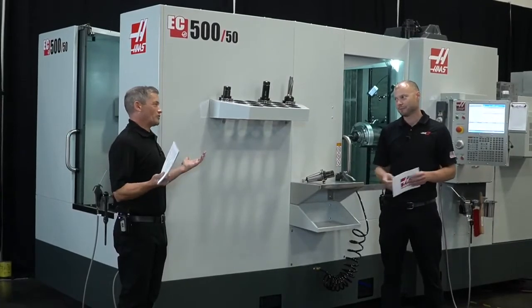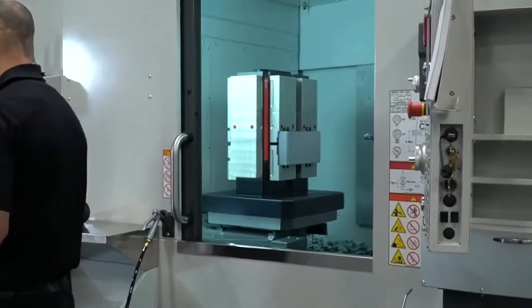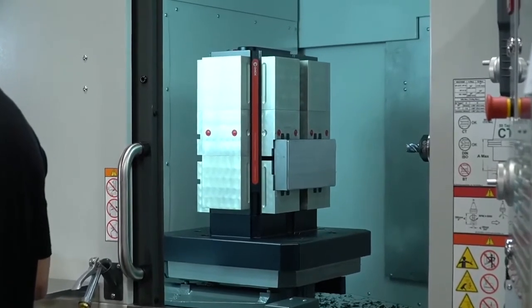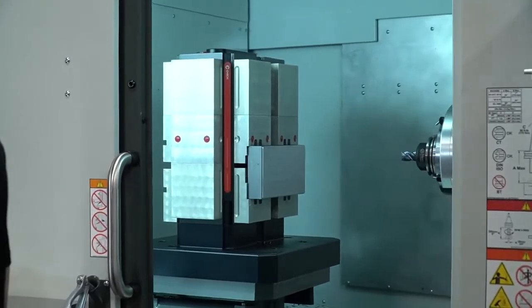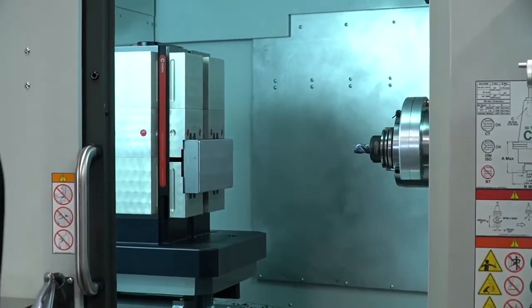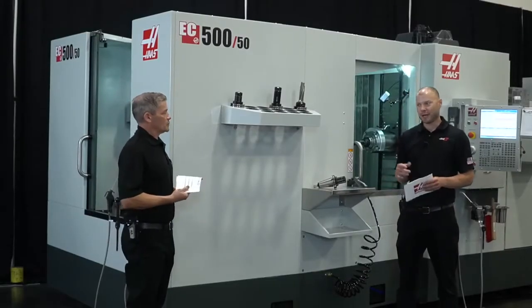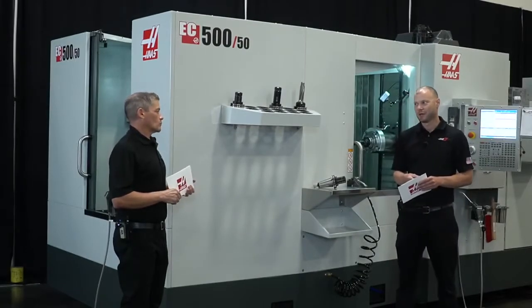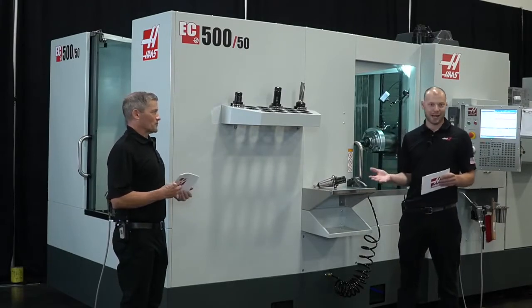Right. So obviously, that's part of the reason you're buying an HMC for sure. Exactly. And this cycloidal drive maintains the kind of accuracy we had with the earlier worm gear style rotaries, but it is more crash resistant, which everyone can appreciate. Absolutely. Nobody likes screwing up an expensive 4th or 5th axis, and some of them can be kind of delicate. But yeah, we've recently transitioned to the cycloid drive, and we found that it is much more resistant to damage after a crash. And I think all production machinists know we're counting our time down till the next one.